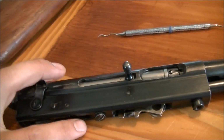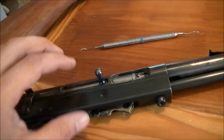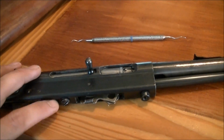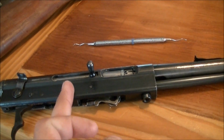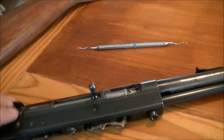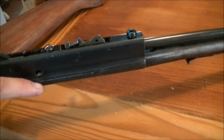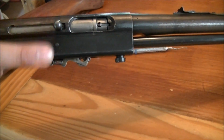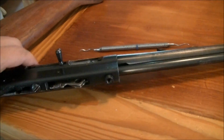This is the second rifle that I've had in here in the last 6 months with the same exact issue. After I got the chamber floating, the rifle still wouldn't cycle anything. So I broke everything down and found that it was so crooked, the spring wasn't even sitting in its cup to push on the sear. It was just sitting out at an angle, pushing on nothing. So you could turn the rifle upside down and fire it because the sear would fall and catch onto the hammer. But when you turned the rifle right side up and fired it, the sear was falling away from the hammer, falling down, so it wasn't catching. So I redid that. Now the gun's shooting great.